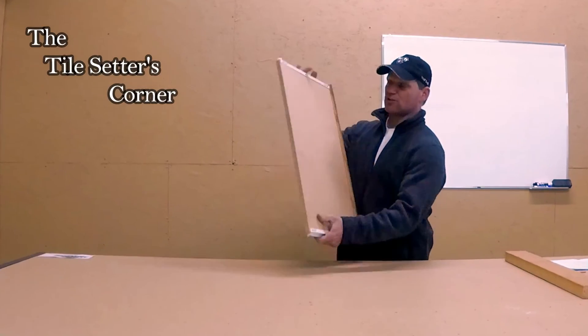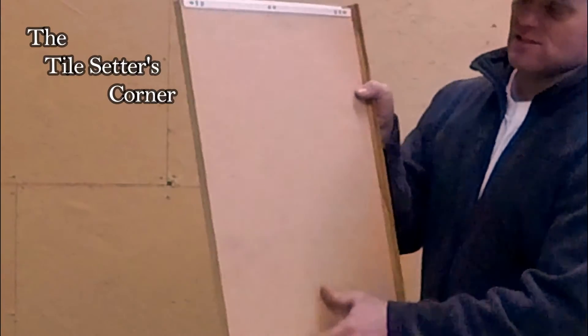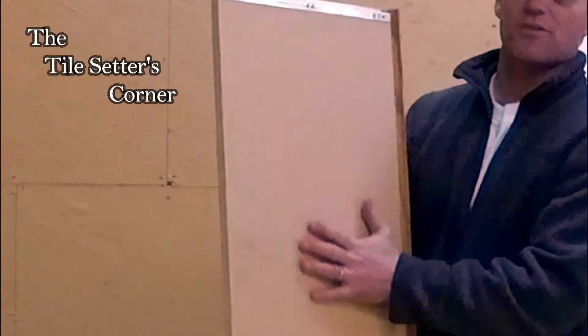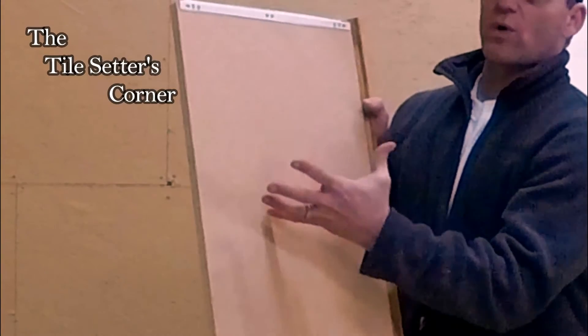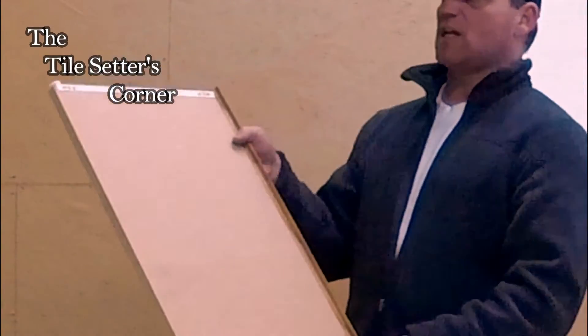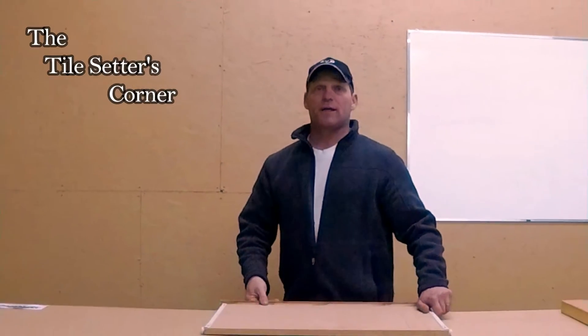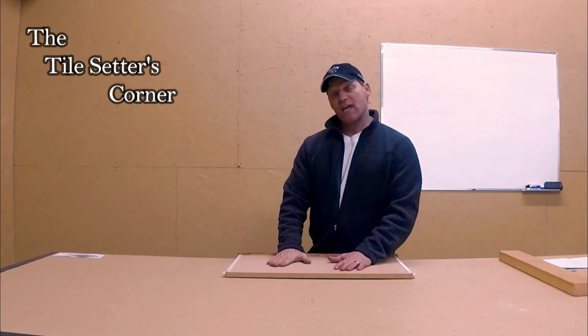Another thing is K3 flooring, and that's what this is here. I just used a piece of desk material — this is what I have for K3 — and all this is is wood that's pretty much just pressed together. What happens is if you put a little bit of water on this, it will swell right up. You don't want to use this. A lot of times you're going to see this underneath the vinyl flooring when you prep for the floor, and as soon as you rip up your vinyl flooring you're going to see this.